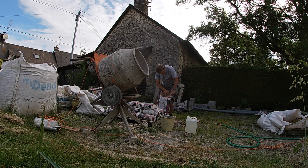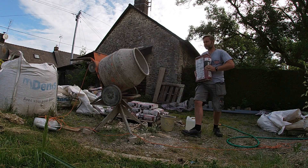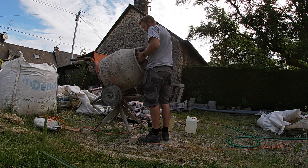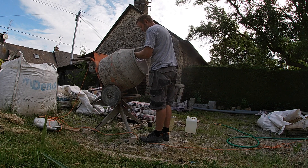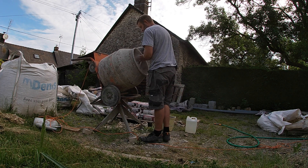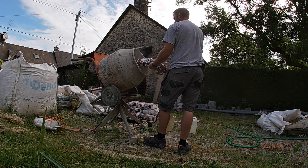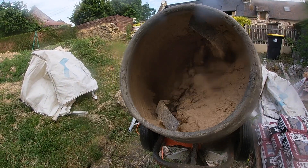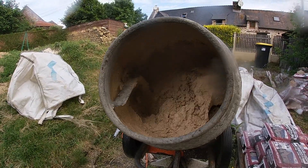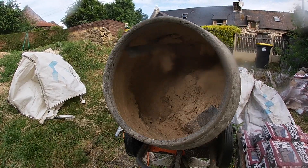The open time on the bag: once you've mixed it and applied it to the wall, you've probably got about an hour. Then once it's on the wall you want to wait about two to three hours before doing anything else to it. You do have quite a long time to work with this stuff, and it will mix in a normal cement mixer no problems. Two bags, 10 litres of water gives you the perfect mixture.